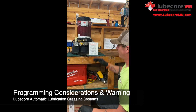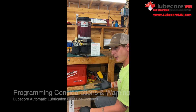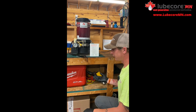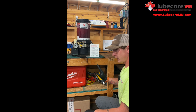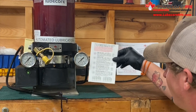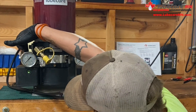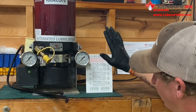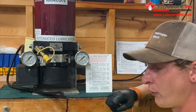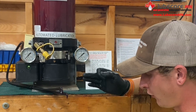Now with programming one of these pumps, you want to be a little bit careful. It depends on if you bought from our supplier and installed it yourself or if you have one of our LubeCore technicians come and install it for you — they usually have it set to where it's worked for us in the past. On this one in particular, you have a 6cc and a 2cc element. Normally if this was on a loader application it would run for two minutes every hour, or on an excavator, four minutes every hour.